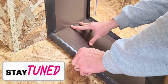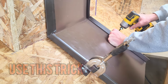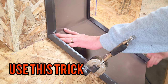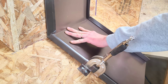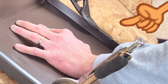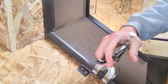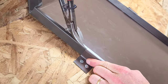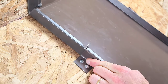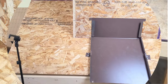We can now take the panel to the chimney, lay in our clips, and I'd like to show you the clip snip trick to prevent that panel from sliding down the roof. We're going to snip along the top of the seam, lift up, and bang it over. As you can see, the panel is already staying up and not sliding down the roof at all. We're cutting the top of the male seam and bending it down and over the top of the clip — it top-hooks down and you cannot pull down on that thing.